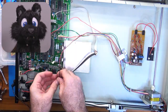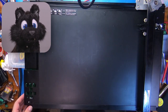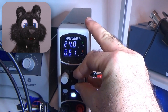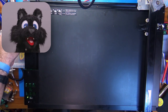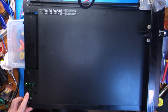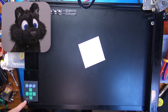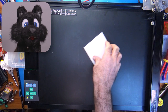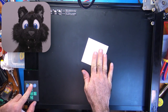And now the moment of truth. I did not bother to pre-order a power brick for it, as I did not know what exactly it needs besides 24 volts and maybe up to 1.5 amps. So I set my lab power supply to 24 volts and opted for a conservative setting of point-something amps. Power on. Woohoo! It homes into the limit switches. I can also control it with the cursor keys. Trying out the paper holder next — success! Wow! That paper can be peeled off of course, but it's not sliding anywhere while that thing is on. Nice! And the fact that I did not get shocked means the high-voltage part is working properly.